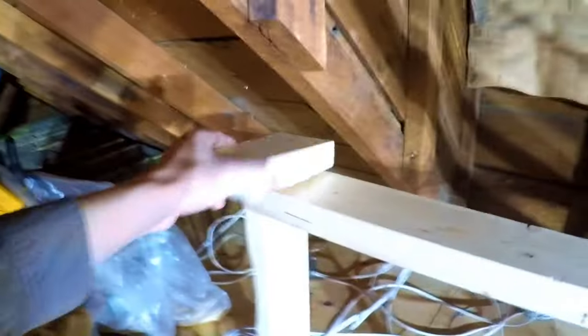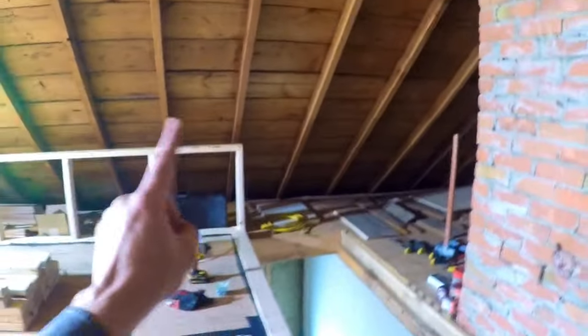And then when I go to attach the 2x4 that's running along this way at top there, I'll copy that measurement, and that way I know everything will be symmetrical and right in the center. I'm going to use the laser level because my plan is to lay one of these flat, mark it out, go to the other side, do the same thing, and then when I have the laser up there, I'll be able to see exactly where everything lines up, because technically the end of the board, the 2x4 that's running lengthwise, will be the exact end of the board, so I'll know I have something to measure off of.